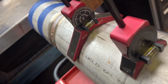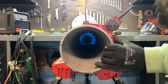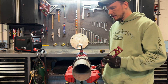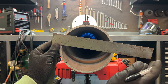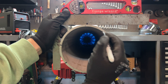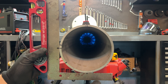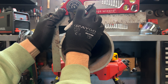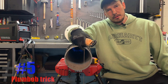Tip number four: a unique way to find top dead center or any degree on a pipe or round stock. Most pro tradesmen carry center finders that let them find and punch any degree around a circle — I'll link those below. But you can do the same thing with just a square and a level. Find the OD — mine is six and three-quarters — so I mark three and three-eighths, then slap a level on top of the square. Once it's level, that mark is top dead center. You can do this for the sides, bottom, and 45-degree points. With a fancy level that has a protractor feature, you can mark any degree around the entire circle — for example, a 20-degree mark.